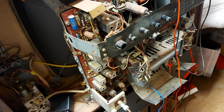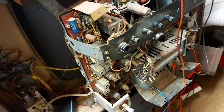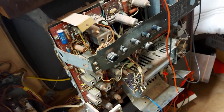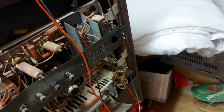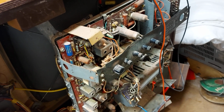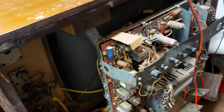If you can get some sort of picture on the TV, get the TV working to some sort of extent, to see if you can see anything on the CRT. And if you can't, then you know it's not viable going forward. It was probably all right back in the day where you could throw a tube in the bin, although they were very expensive. But you could always bring it to a re-gunner or whatever. We don't have that option anymore. And even if there was someone re-gunning tubes now, I don't think it'd be financially viable for the kind of sets that we're doing here.